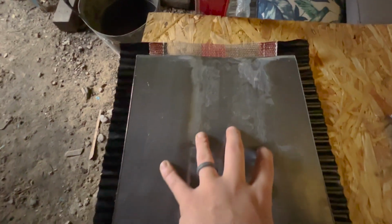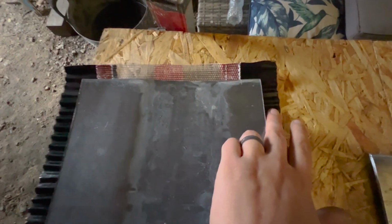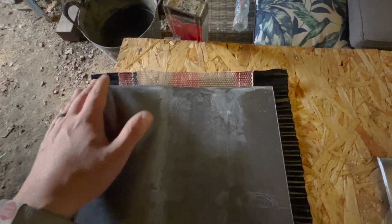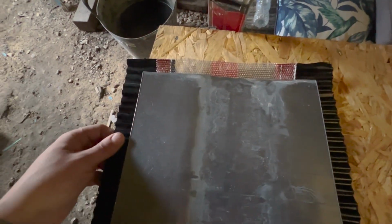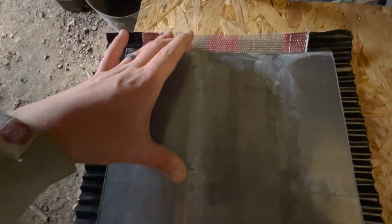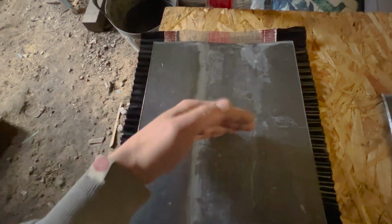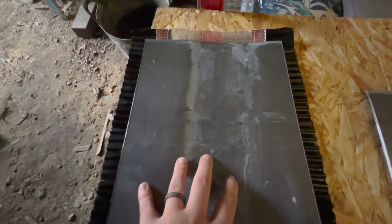This is the lead saddle I was talking about. It's going to go over the ridge between my join and the neighbour's join of the ridges. I've made it about 25mm shorter than the actual dry ridge. I don't know what you call this, fabric membrane flashing. This will sit over about 150 into the neighbour's tile and 150 into my tile, and create a nice runoff if any water does get in between the mortar, and stop any water ingress into the roof. This is the plan, guys.